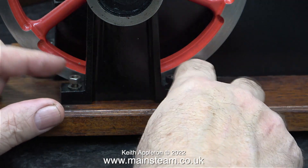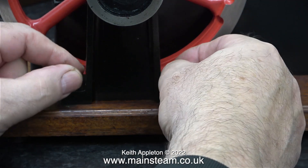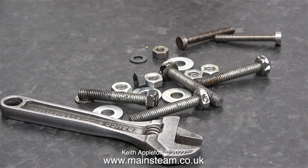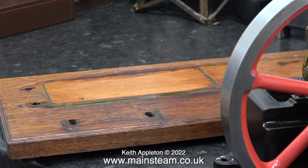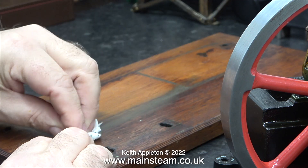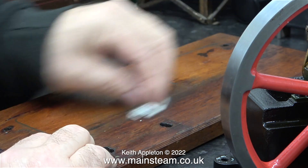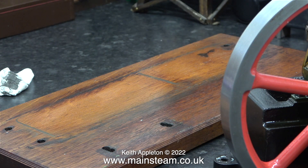The pedestal supports the outer main bearing and it's only held using two 2BA bolts with corresponding washers and nuts. Using both hands at once, in no time at all the fixings are on the bench. This beam engine has been bolted to this mahogany plinth for a while, and the green stuff I'm wiping away is the residue of steam oil because I have steamed this on several occasions. As a solvent I'm using lacquer thinner or cellulose thinners, but it's better to use white spirit which won't attack the varnish.